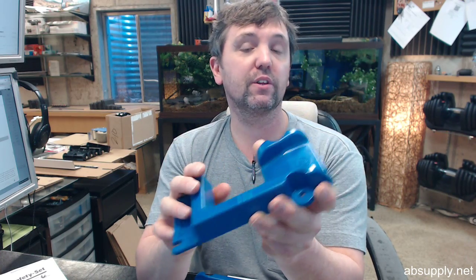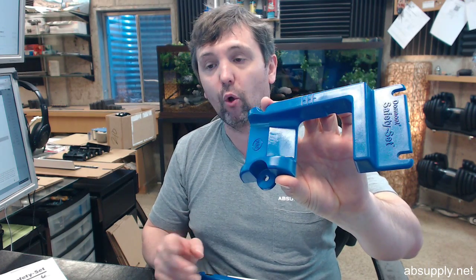Establish the location of each piece of cooking equipment below the exhaust hood and the fire suppression nozzle prior to installation, and be sure that the positioning of that is exactly what the inspector is expecting to see and proper, safe operation. Using a floor degreaser or cleaner, thoroughly clean and dry the floor to ensure it is free of grease, dirt, debris. Then use the included isopropyl alcohol wipes as final cleaning for the installation area. To obtain premium adhesion, the bonding surface of the floor must be clean and dry.